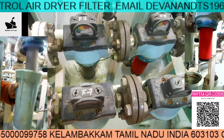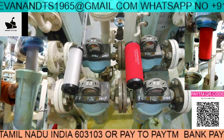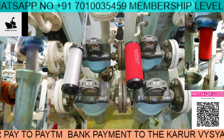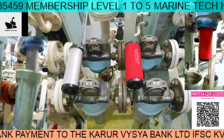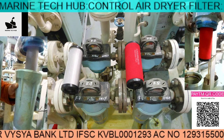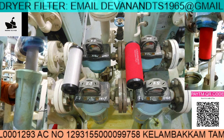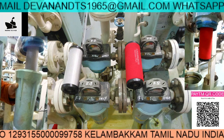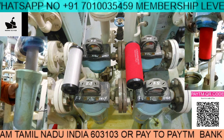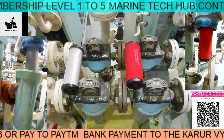Very important: if the color indicator changes from green to red, that means it is time to change the filter. I kept the filters here so that you do not mix them up. If you put both red filters in together, the air will not flow. One time a first engineer put both the red filters together without reading the manual, thinking the filters looked similar — but they are not. You have to make sure you put the correct filter; otherwise the flow will not happen. We were unable to find the fault until we checked and found both filters were the same.